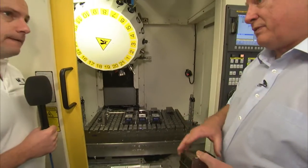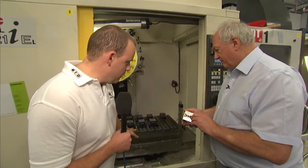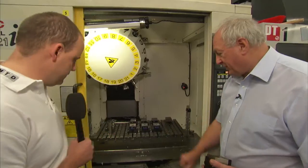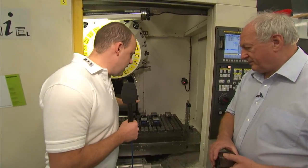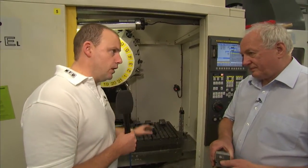The base plate here is not the table that comes with the machine tool — it is actually bolted onto the machine table. You have this manufactured to the size of your machine table, and then you buy vices and location points to the quantity that you require.